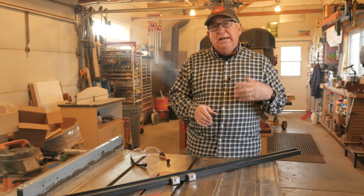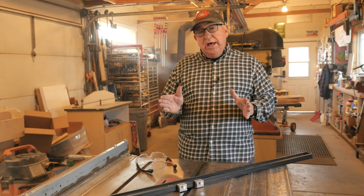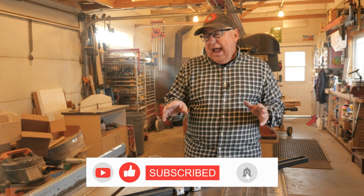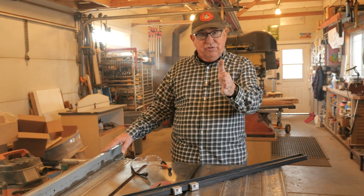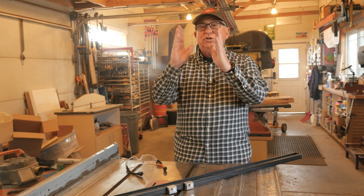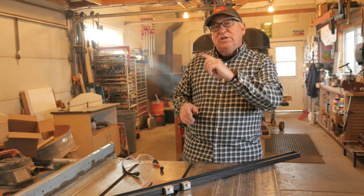love what you get. Now, what this does, it allows you to clamp a straight edge on a crooked board or a board that needs a straight edge applied, and then run it against the fence of your table saw, ending up with a straight edge, which you can then roll and put against the fence to get two parallel straight cuts. Well, let's walk you through this, but first, before I do, I want to tell you a little bit of the story of this.